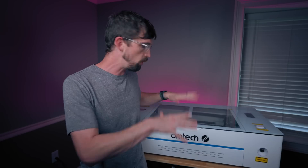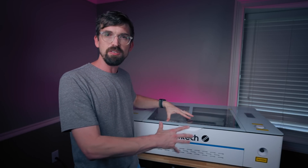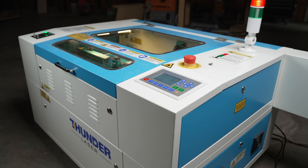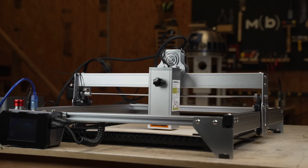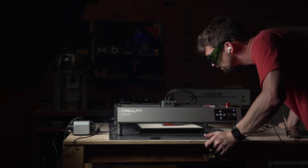Lie number two is something usually left off product listings rather than something listed on them, and it has to do with safety — specifically with diode machines. Behind me is the OhmTech Polar, a CO2 machine that is fully enclosed with a lot of safety features built in. Pretty much all laser diodes out of the box are open gantries — there's no enclosure — so all the fumes that come up when you're cutting or engraving are just out in the air. I always recommend having it in a well-ventilated area. Manufacturers will sell enclosures separately, but it isn't usually built into the unit itself. They really downplay how dangerous that can be, because you can start a serious fire and it can go very fast.